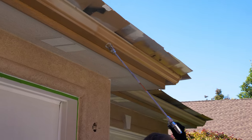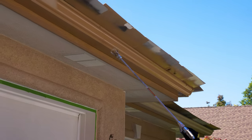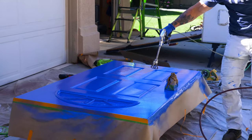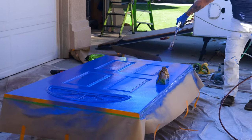A 310 has a six-inch fan width, which covers the face of the gutter in one pass and the bottom in one pass. It's great for spraying front doors — you spray the edges, sometimes the bottom and top — with very little overspray. Sometimes I use the 310 for downspouts too, though often I just use my 515. If you're concerned about overspray on grass or driveways, spray your downspouts with a 310.